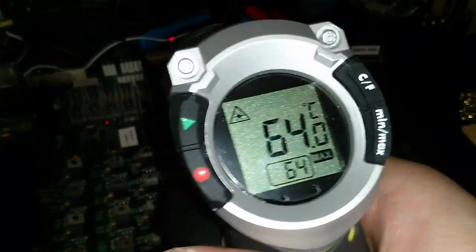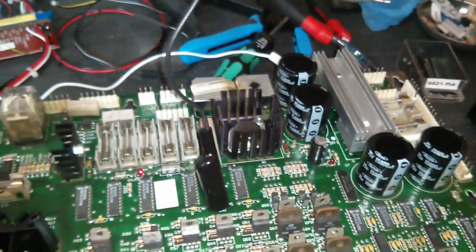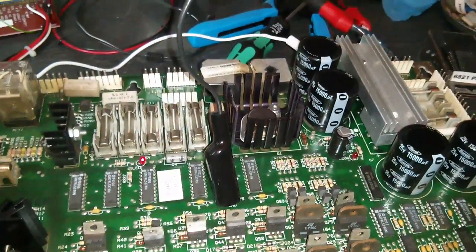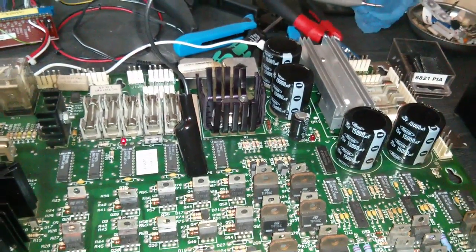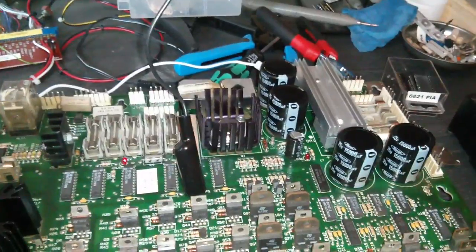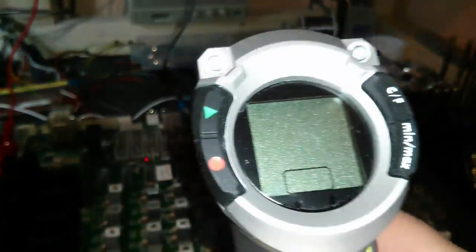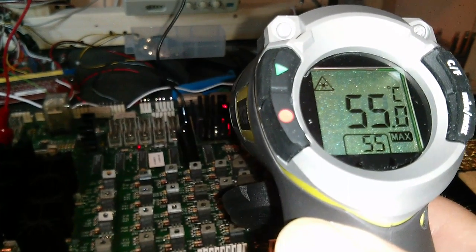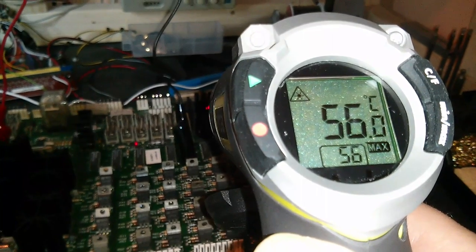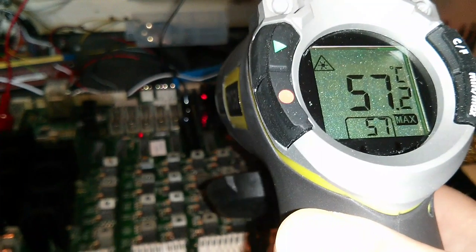How's that cooling down now? Yeah, 75 - it's dropping off. Okay, well it's definitely working, and it's definitely able to generate up to 2.8 amps, although it would get very hot doing so. I want it to cool down, and I'm going to run it at 1.5 amps for half an hour, just to make sure it works nicely and doesn't get too hot. Here we go - 54, 55 degrees. That's a lot more respectable. Still fairly hot, but it's linear so it's not efficient. 54 to 57 degrees across different parts of the heatsink - I think that's acceptable. That's working fine.